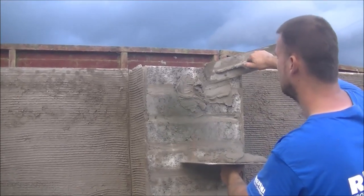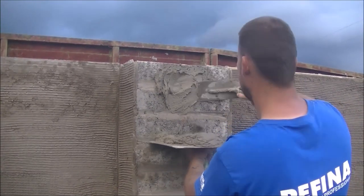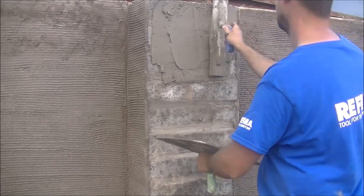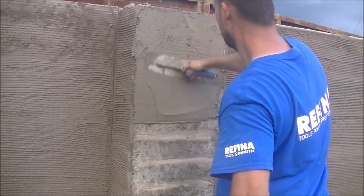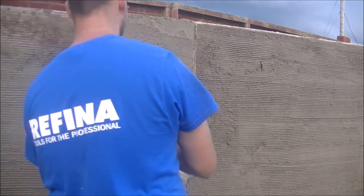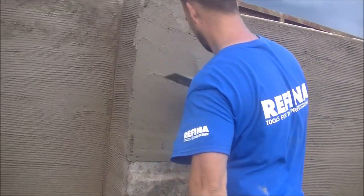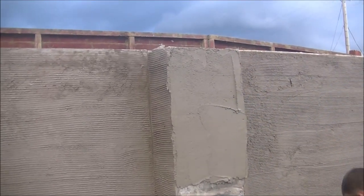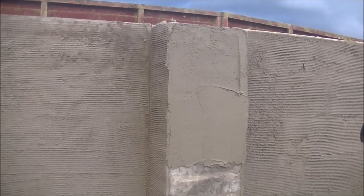Using the Kango here to widen them out. Just giving it another dry fit — fitting lovely and exactly where I want it. Going to fully fill out these holes to bomb the pins in as well. Again, this is scratch coat with SBR in it too, so it will be really strong when it sets. Hopefully you just got to see the video before this where I scratch-coated that wall. I'm going to try and put some more detail on this wall, but we'll get to that — make sure you subscribe so you don't miss out.